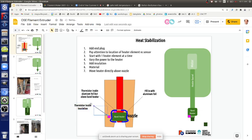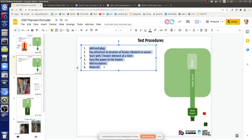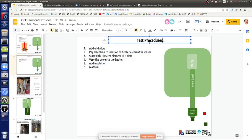But I do feel like it is just heating to the right temperature, and at that moment gravity could do its work. Yeah, it was already working through the nozzle. If you look at the nozzle, the pellets were already melted and wrapped around. It was basically already working, except it's a bit too hot. The extrusion was not quite right. So let's talk about what are the four or five ways to vary the extruder push? Varying speed.